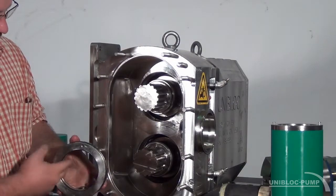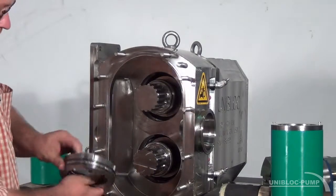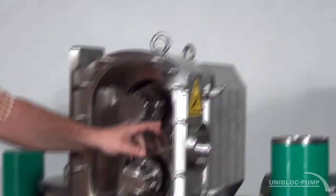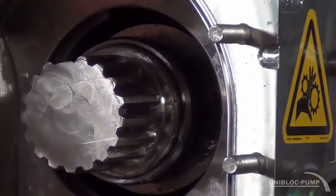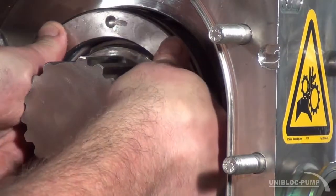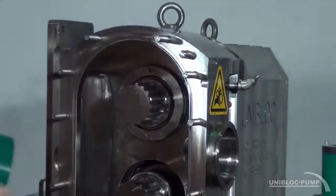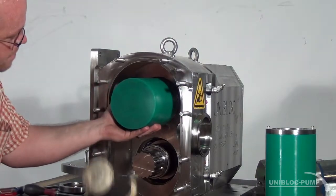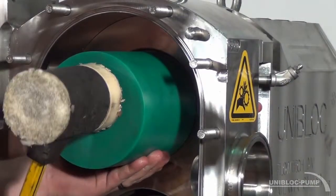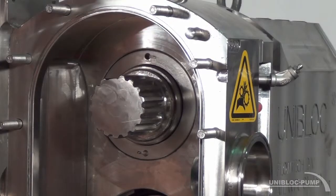You'll want to put your FDA grease on the inside o-rings on the o-ring seal retainer as well as on the outside. The alignment slots will need to line up — there are four grooves back here for the o-ring seal retainer. Make sure they're lined up so everything will go in as it should. Just get it started, and use your seal installer and a rubber mallet and give it a couple taps. Your o-ring seal is in and ready to go.